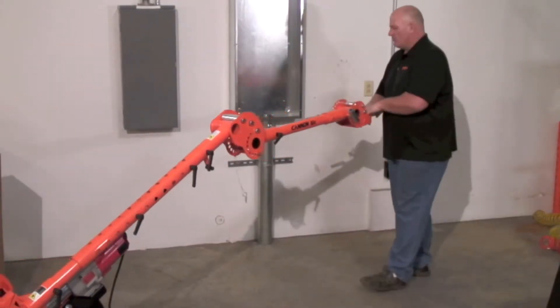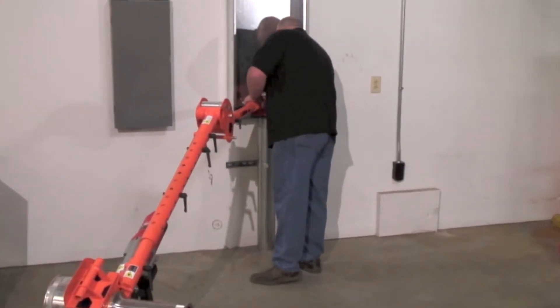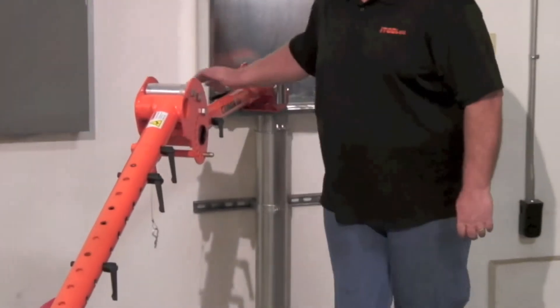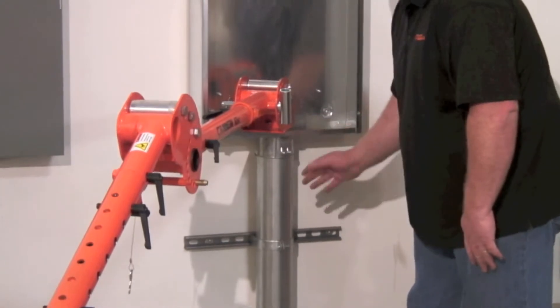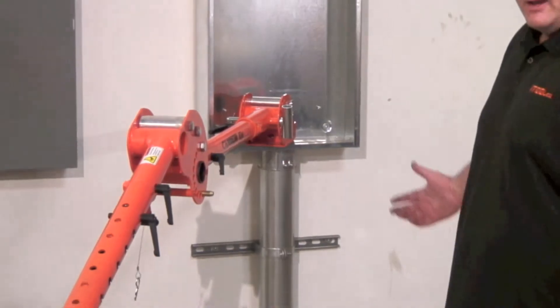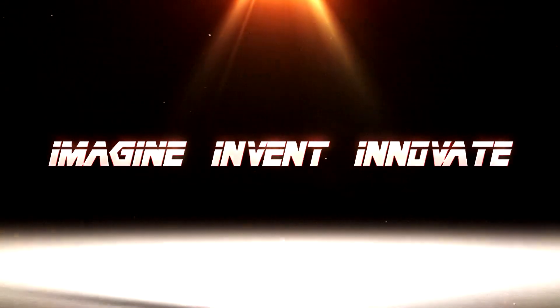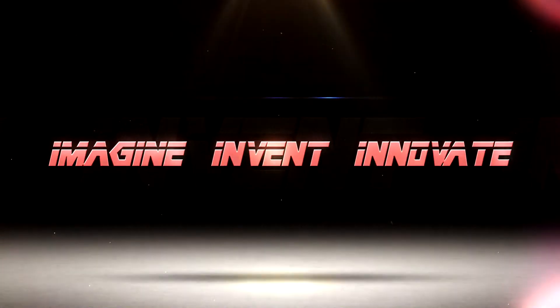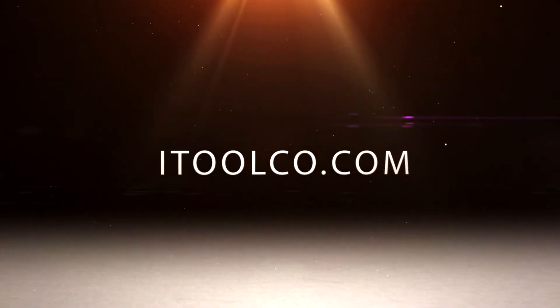That's going to sit right over your lock ring. Basically, set that thing right over your lock ring, right over your pipe. All the force is going to be transferred through the pipe here that you're pulling through, so you don't run the risk of pulling your gear off the walls. Basically set up for a wire pull right there — that quick and easy.